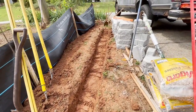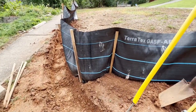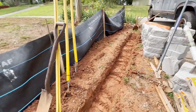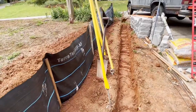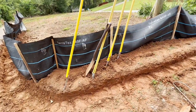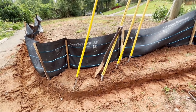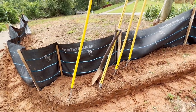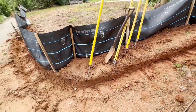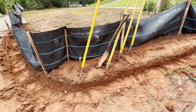When I dug the trench I stepped it as I went — ideally one block deep. If it gets a little deeper, that's actually fine. If you're wondering about these guy wires, I did check and there is no easement — the power company just sticks them in your yard and they've been here like 40 years. I'll lay in the fabric and the stones and get the first course going, hopefully beat the rain which is forecast for this afternoon.